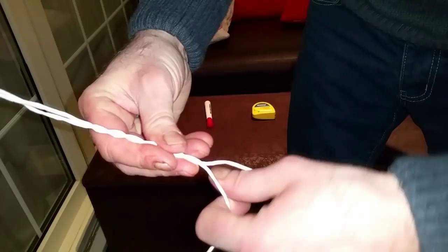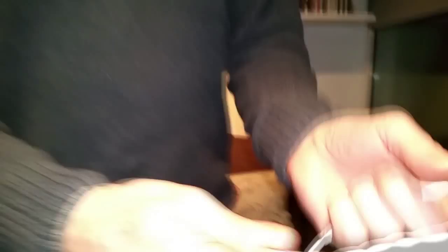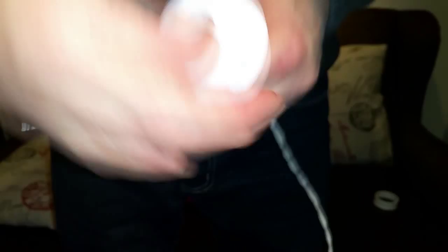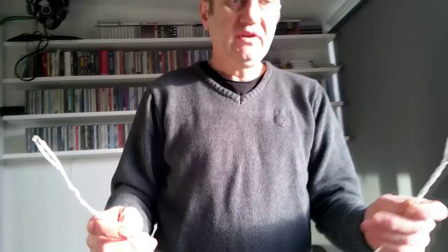We have now twisted both conductors together. Now we've got to cover from that point to that point all in PTFE tape to hold the twist in place so it doesn't move. We're only going to need one layer of PTFE tape here because we are going to cover it all in heat shrink. Now we've got our two conductors PTFE taped together after twisting them into a twisted geometry.